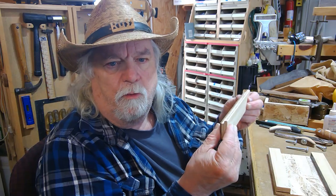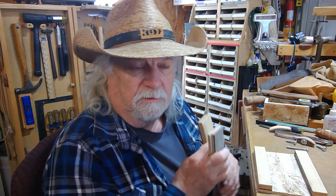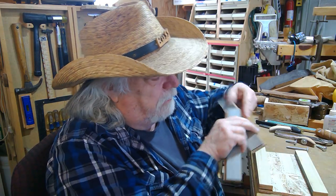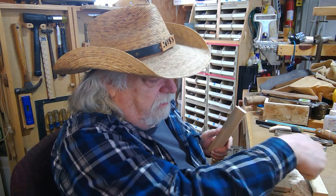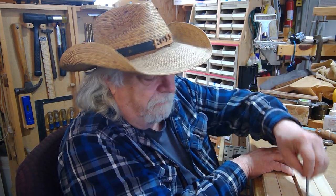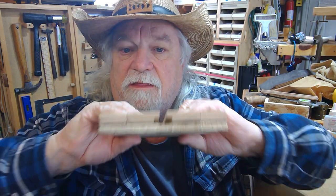There are other ways to make one — I'm going to show you another one today. Take the three-quarter inch pieces after we've split them, and now we're going to make a dado. Basically to make a T-track, all you have to do is cut a rabbet and cut a dado. Take the two halves and put one against the edge here, and if the width is set properly, put the other one against the other edge. You end up with a quarter-inch gap between them — that gap is what your bolt slides along.